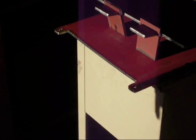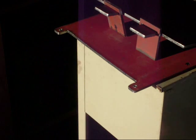And if you can see, I'm going to be using a 36 grit. I don't know if I could focus that. But we're going to just remove some of that material so I can get a good weld. Let me get some eye protection, and we'll clean that up. You may want to turn down your volume.